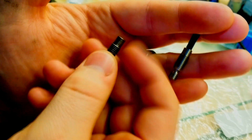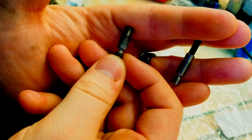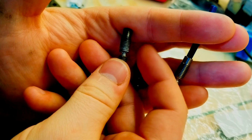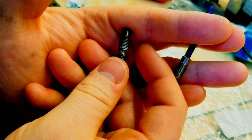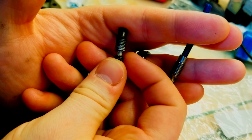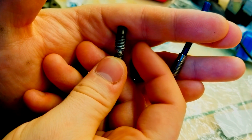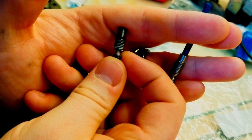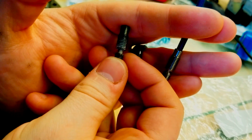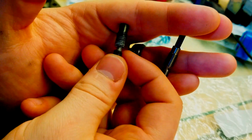So the filament diameter, and that's the plug there, the filament diameter is 1.75 millimeters. You don't want to get much bigger than that, or you'll start having slop in here, and then you'll be able to form those plugs by just pulling up, because the amount of filament feeding in from the top is 1.75 millimeters, and so you'll have a cold inside but a warm outside as it flows through and becomes a liquid, and then it flows back up. The middle will want to pull, but the sides will want to stay whatever temperature the metal is, right? So that's part of the cause here, is that there's a larger inside when they manufacture the inside of it, but also the outside.